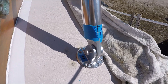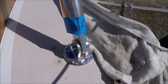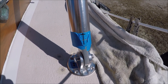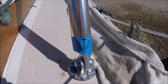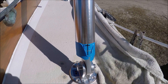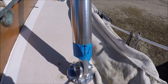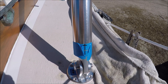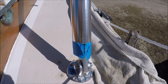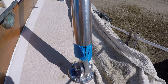Now we've marked the deck and lined up the bases where the screw holes would go through the deck. We've taped them together and five-eighths of an inch up from the end of the pipe we've got a mark for drilling for a quarter-inch bolt. The instructions say you can either put in two tapped quarter-inch bolts at 90 degrees apart or just drill right through with a bolt and a nut, which is what we're going to do.